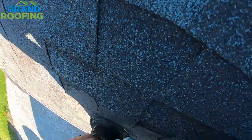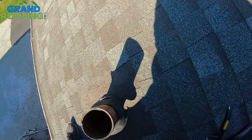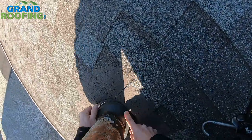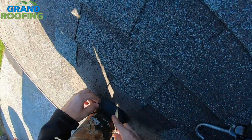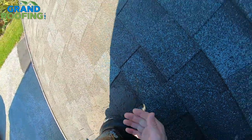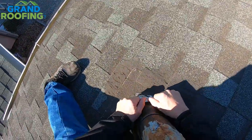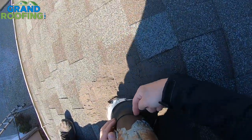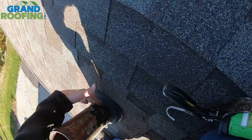Let's see what it looks like now. Keeping it with the downward slopes so nothing comes up under. That's mainly because of the pitch of the roof coming up so high to the backside of that pipe boot. If there are some rough edges and you've got a gap, it won't hurt to seal that — not quite necessary if it's making a good seal.